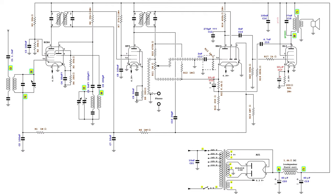After the initial cleaning, the circuit is analyzed and written down on a draft schematic diagram, beginning with a simplified representation of the antenna and oscillator coils based on the converter tube general documentation.